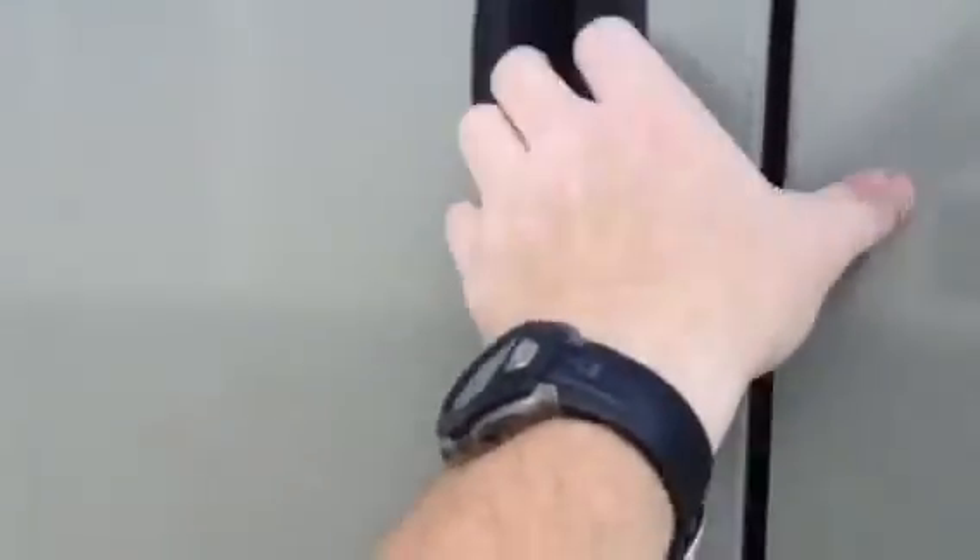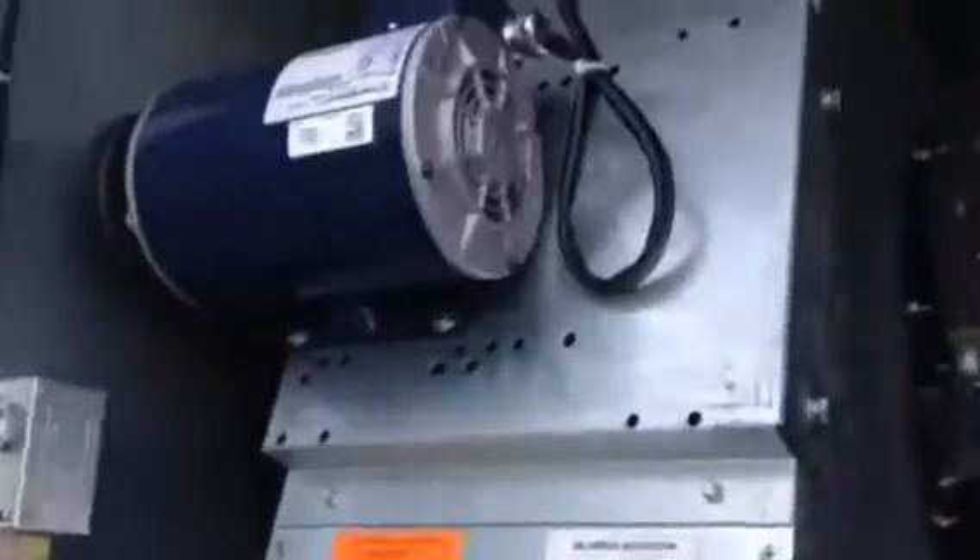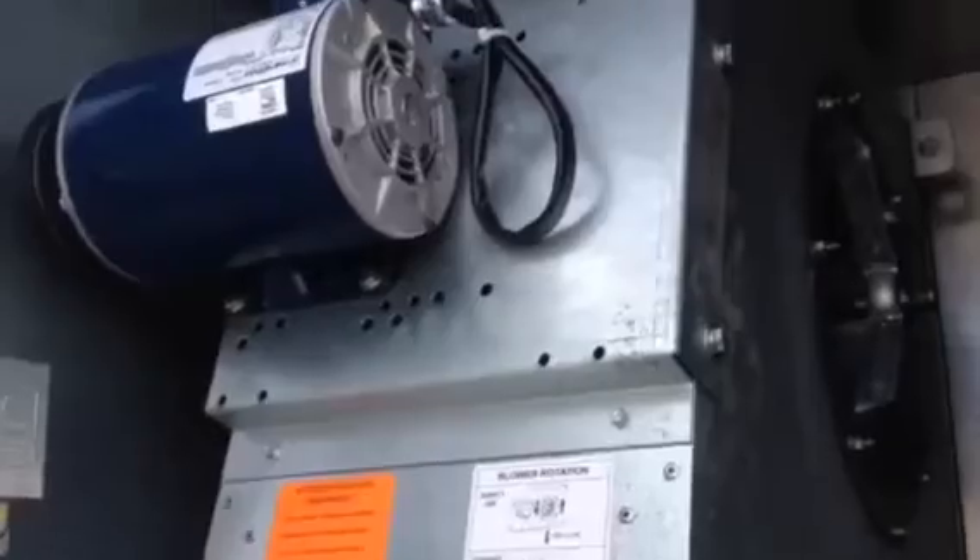This is my blower section, my supply side. There is my blower — supply side of the coil. Right now they have a sealed box right here. A lot of units are not sealed so we can just stick our supply temperature probe in here, or we could just drill a hole and penetrate through here. But fortunately, this unit has some external duct work, so I am just going to drill a hole out here and stick my supply probe in there. If you needed to, we could stick it down in here and get our supply temperature and we would be good to go.